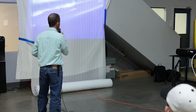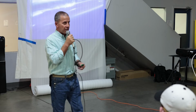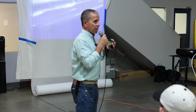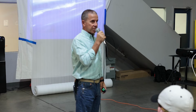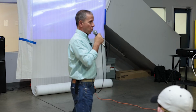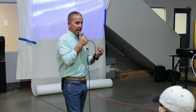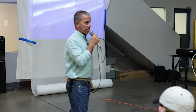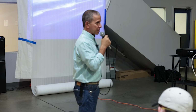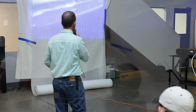The other issue is areas of entrapment. You've heard me say that a few times already. It could be two metals that have come together, a flange installation that is trapping water against a painted surface, or it can even be a non-metallic structure like a plastic or a non-metallic bushing or washer that has a void between it and the painted surface, and water is getting into that void and being trapped there. So be mindful of that. Any place that creates a gap against a painted aluminum surface is the potential for corrosion.